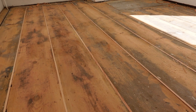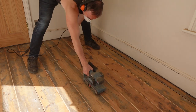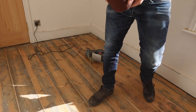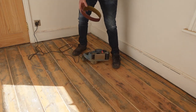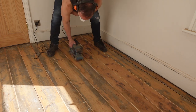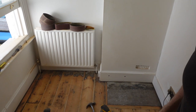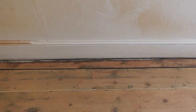Now it's time for some more sanding to get it all nice and flat and level. I'm going to go over this with P40 grit — very rough sandpaper. The belt has arrows so you can see which way it goes onto the sander. It's really dusty — hard work, I'm breathing in dust, I think I need an industrial face mask. Anyway it's coming on, it's really quite good now. I'm just going to use my small orbital sander with a rough grit to get underneath the radiator and around the edges as well.